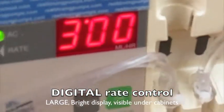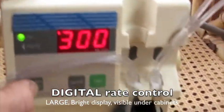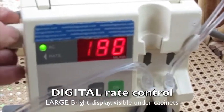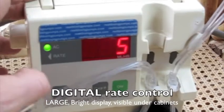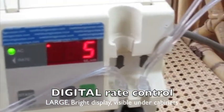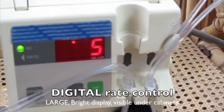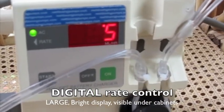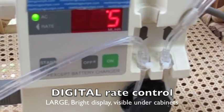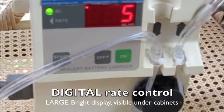To change the rate, you basically hit start and hold. Then digitally you can adjust to as low as a setting of five, which translates to one and a quarter milliliters per hour per channel. You'll notice now that the rotor isn't turning because the timing cycle has slowed the output down to a much lower rate.